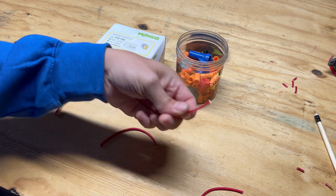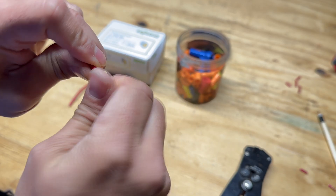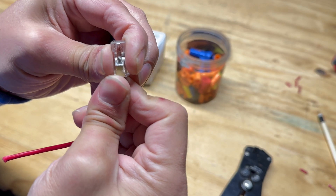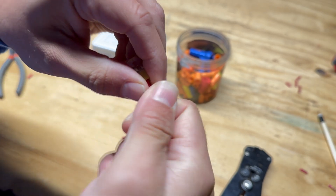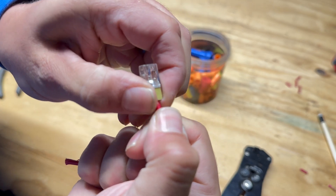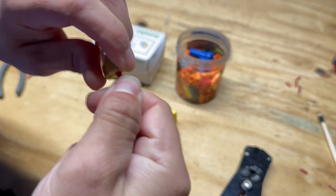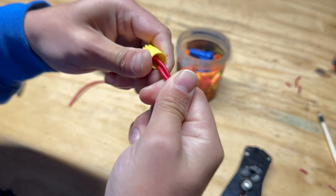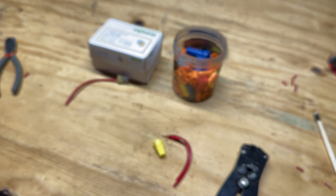When you're dealing with mostly solid wire in a house, it's a different conversation. But when dealing with stranded wire — if you've ever tried twisting two stranded wires together and joining them with a wire nut, you notice the wires just loop around each other and you're not getting a great bite. For a stationary house that's probably fine, but in an RV or camper van that's traveling down the road and subject to vibration, it doesn't take much for that wire nut to spin a little. Here I'm really pulling on this Wago connector and it's not budging. I even try to spin it — great connection.